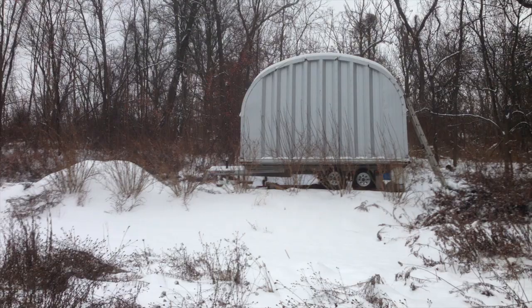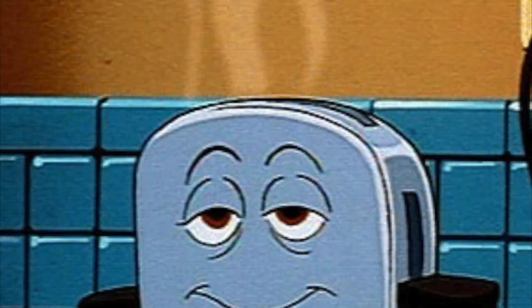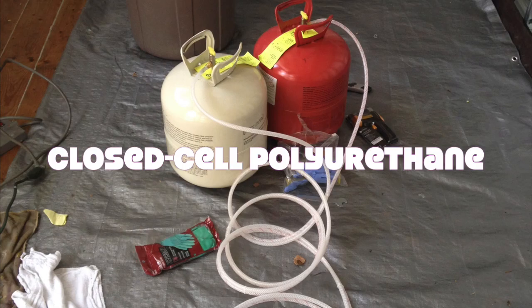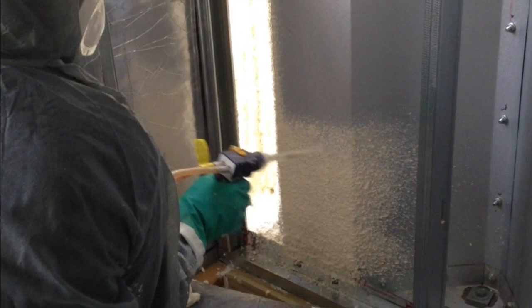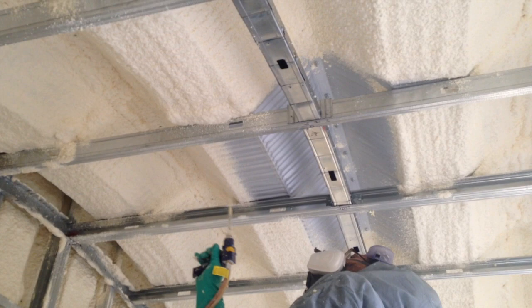In order to insulate the rest of the Tiny House of Steel and prevent it from turning into a giant toaster oven, we had to find the perfect solution. Enter closed cell polyurethane spray foam insulation kit. Now this stuff is messy, expensive, and the conditions have to be just right for application. Not only does it prevent the steel walls from heating up or cooling down too quickly, preventing condensation — for the hidden graffiti artist in you, it's a heck of a lot of fun.